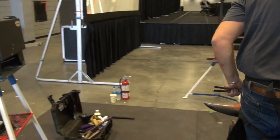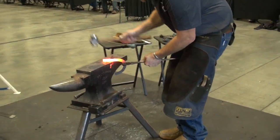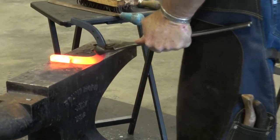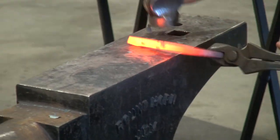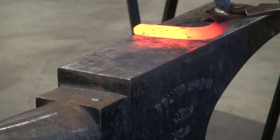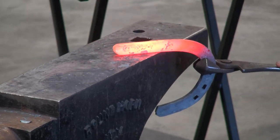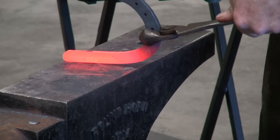Quality and fit: the shoe is true, smooth, without pressure burns, hammer marks, or rasp marks, and your nail hole location is properly located from the point of the quarter to the complete space. And there are pictures in this guidebook to describe the different variables of each category.